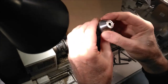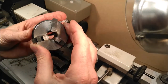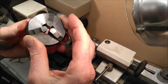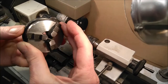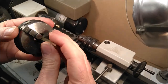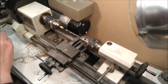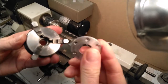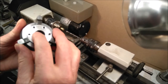Many people will be familiar with the self-centering three-jaw chuck. Self-centering in that all the jaws come in together - it isn't necessarily that self-centred, and nothing like as good as the drill chuck. Nevertheless it's really useful for holding round stuff. And because there are three jaws, it quite conveniently will hold hexagon material as well. That's fine for small things. If you want to hold something a bit bigger, you can actually turn the jaws round and use them the other way round. Here's an example of holding a ring, and that's a classic use for a self-centering three-jaw chuck.